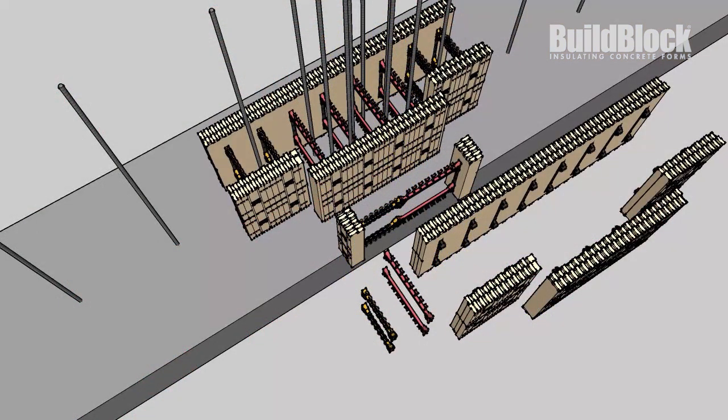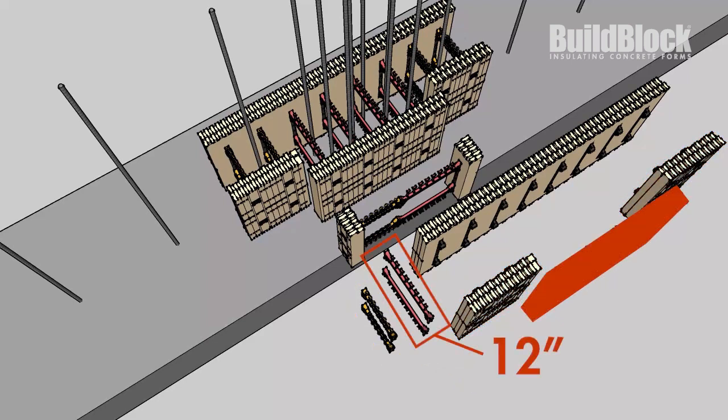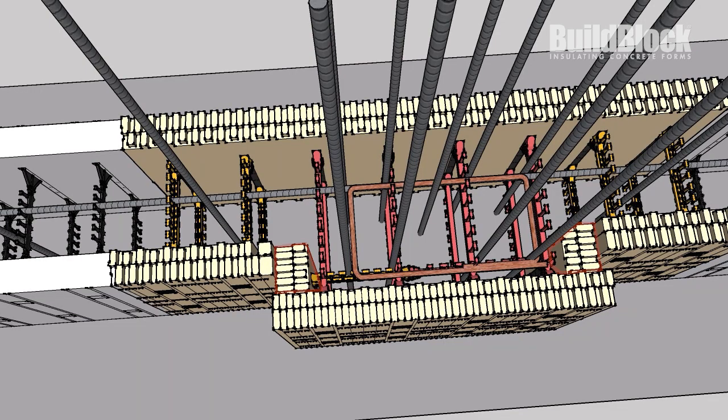Next, we'll cut one of our panels into three pieces — two at 12 inches and one at 24. We'll use 8-inch webs for each of the 12-inch pieces, and a 12-inch web for the 24-inch piece. The shortened 24-inch piece is meant to butt up against both the 24-inch and 12-inch pieces. It provides enough bracing so that no additional strapping is required.